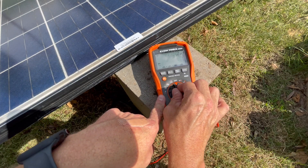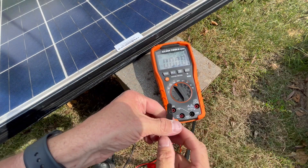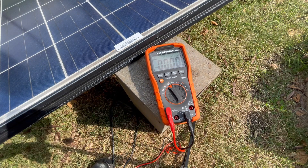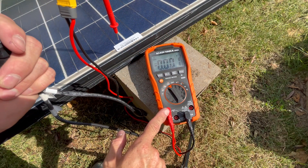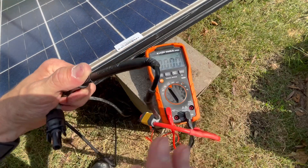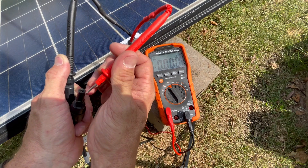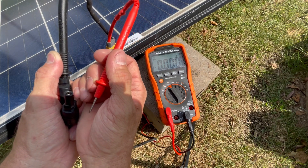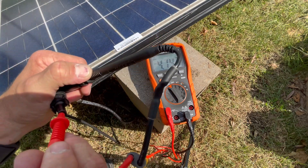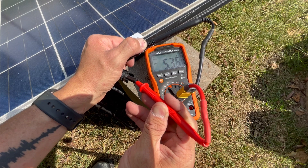For assessing amps, switch over to amps and switch your positive conductor over to amps. After you switch over the conductor, make sure it's on DC amps. Same test — start with the ground. That is not something you absolutely have to do; that's just my preference. I believe when you're dealing with electricity, it's always a good practice to start with the ground. You can see we're at 5.35, 5.36 amps.